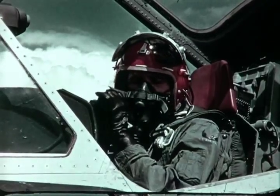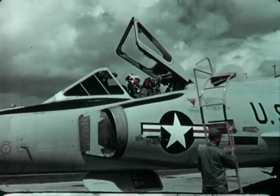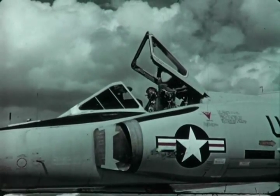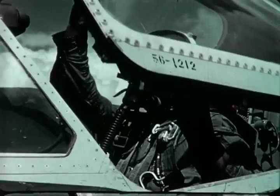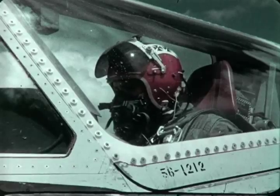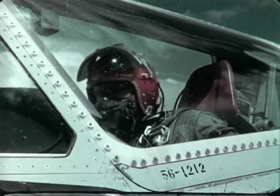Flights with the A-13 mask should not be made at altitudes over 43,000 feet. Decompression with the A-13 mask above 43,000 feet could be fatal. If decompression occurs above 30,000 feet, descend immediately to at least that altitude.